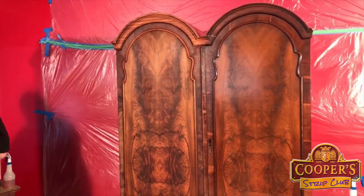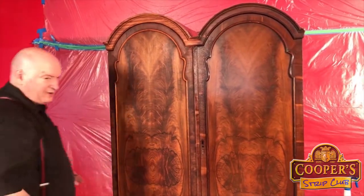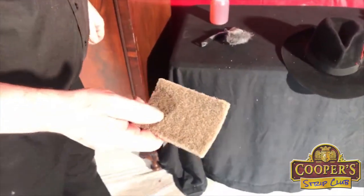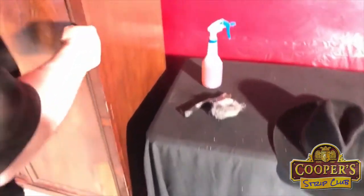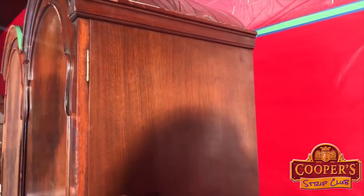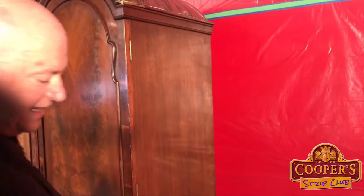There are a couple of things that we have in our packs that we didn't use, which I will put over there anyway. We have these grip pads that we will probably use on the side, where it's a straight grain. So any chance of a quick squeeze of that? So this is mahogany, the front is a veneer walnut, but on the sides we will use our more normal system where we're using steel wool and grip pad and that type of stuff, because this grip pad will get into that with the flusher. But like I said, on the front, the veneers we wanted to protect.